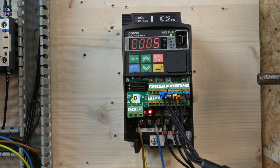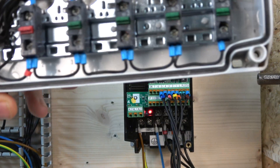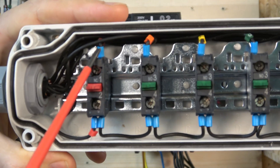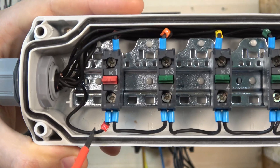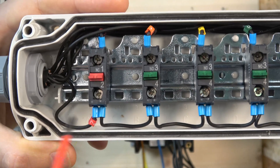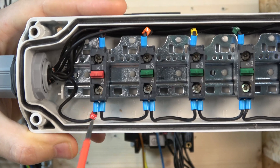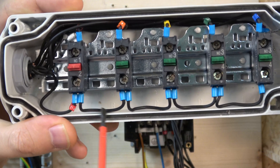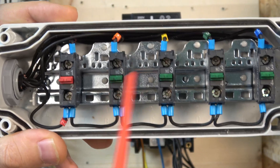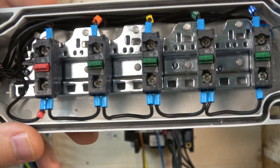Let me show you the actual wiring. We have a P24 coming to our normally closed contact, going through that normally closed contact, and as you can see there's a wire going back to terminal three. If you haven't watched the last video, we inverted terminal three to be a normally closed contact, so it needs to have power at terminal three to not trip. It then distributes power to all the switches: terminal one run forward, terminal two run reverse, terminal four going up, and terminal five going down.